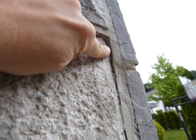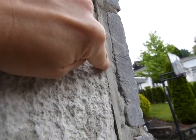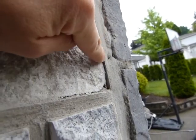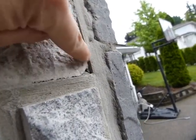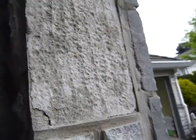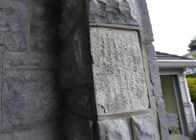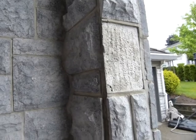Starting in this corner there is just a tiny bit of mortar tapering off to nothing — that's not enough. This is not how mortar joint work should look like on brick face veneer or on any kind of masonry. This is unbelievable.